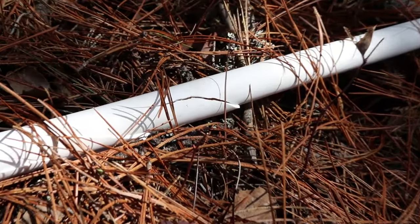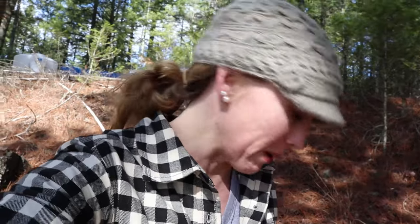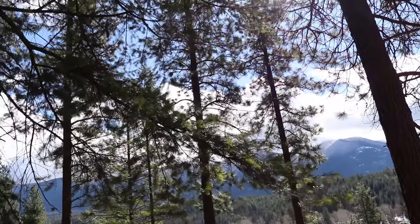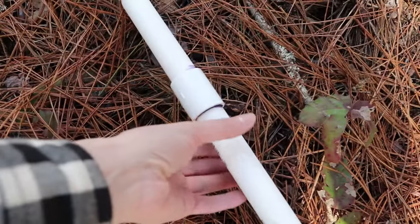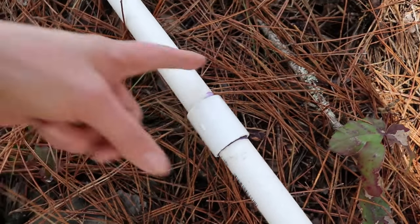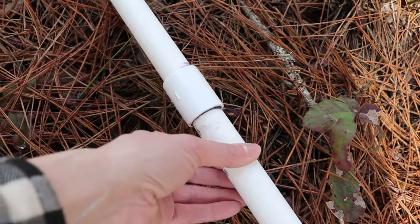Oh, do you see that? I don't like that at all. Turns out we have damage on the pipe itself. This three-quarter pipe that we're using comes in ten-foot lengths, or at least the stuff that we bought. So far it seems that we only need one of those, but I'm sure I'll find more by the time I get to the bottom, so let's keep looking. We can't simply just replace this pipe because it's glued to this pipe. What we're going to have to do is cut it off here with a saw and then get another connector and another section of pipe and glue that together.